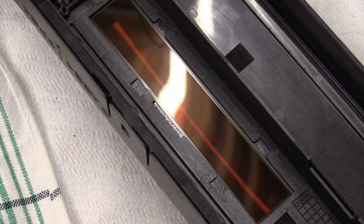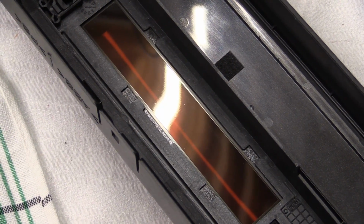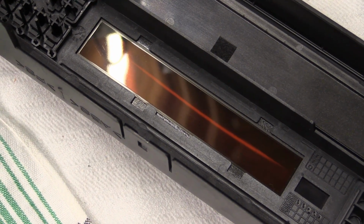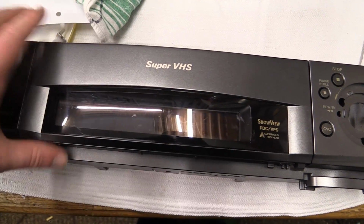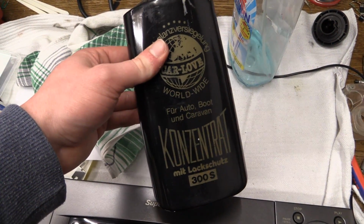Here is a tip that I have when it comes to the cleaning. Clean the inside of the display window. For some reason these vacuum fluorescent displays attract dirt, and it all starts sitting on this filter. This spot is what I cleaned off of that window right there. With that all being nice and clean, the display is going to look nice, bright and sharp through that window. And another tip, to polish these plastic parts with scratches in them, use some car polish.